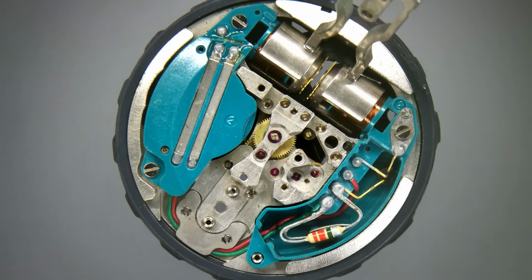At least I've got myself out of trouble. Well, here we are on the other microscope, a lot more sensitive and a lot closer, as you can see. And now we're looking at these amazing teeth. When you think about this wheel is 1/1000th of an inch thick, and it's got 360 teeth cut into it. And what we're looking for is to see that they're all there for a start.